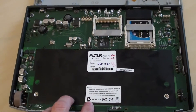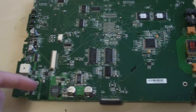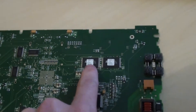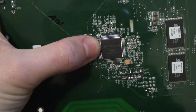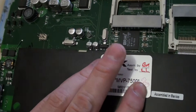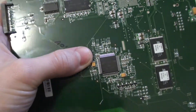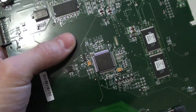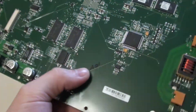On the other side of the PCB you've got all the usual components — a lot of power management, some RAM ICs at 32 megabytes each, a high-voltage cold cathode power supply, and a couple of flash memory ICs holding the firmware. There's also a 16-bit 25 MHz flash microcontroller. I'm not sure exactly why it's there given the system-on-a-chip on the other side, but my best guess is that it acts as a coprocessor to run specific applications whose architecture couldn't be handled by the main SoC.